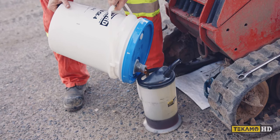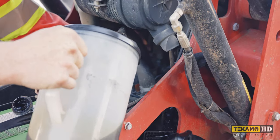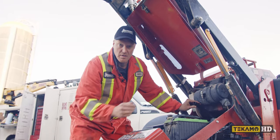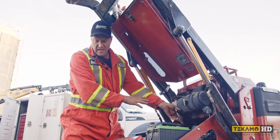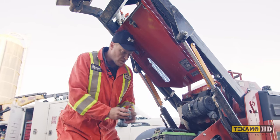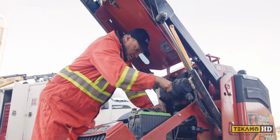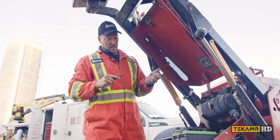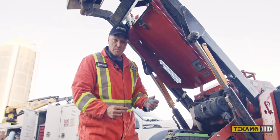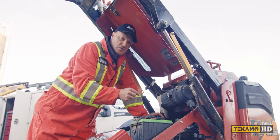Make sure the inside of the hose is clean — if you use a funnel make sure it's very clean as well; we don't want any contaminants getting into the engine with the new oil. Because I'm using a long tube it takes a little time for all the oil to get through, so I usually leave my tube in and take the pour jug off to let it finish dribbling in without making a mess as I pull it out. You want to constantly check your engine oil level as you're filling so you don't overfill. Remember it takes time — we're filling from the top of the engine and it takes time to get all the way down into the oil pan for a proper accurate reading. The colder the weather and the colder the engine, the longer it takes because the oil is thicker when cold.